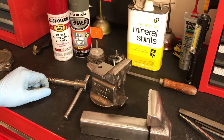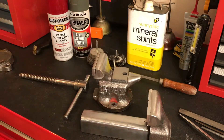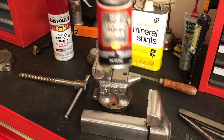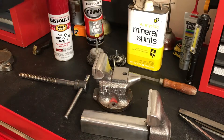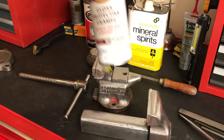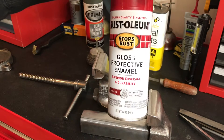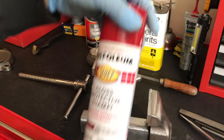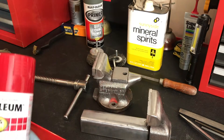There's a tiny little bit of paint in there I just couldn't get out — I even hit it with mineral spirits for a while, but I'm just going to leave that. The next step is to mask it off, use a little bit of self-etching primer, let that set, and then I'm going to go with Regal Red. I'm really excited to see how this comes out — it's going to look really sharp. Let's get to it.